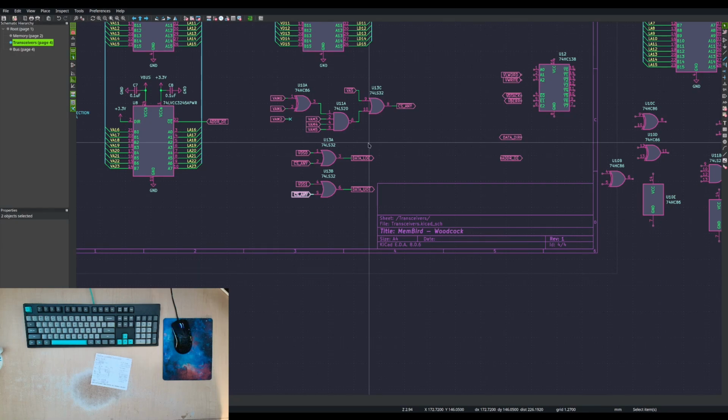Is it even all that practical to have a full 8 megabytes? Maybe I should make 4 megabytes be the max, 4 chips. And then require that it be within a certain area. I mean, the whole point of this card is to be static, to not have programmable logic, and to not do a whole bunch of stuff and have a whole bunch of chips. So, in that sense, making it have to be the upper or the lower.